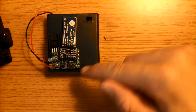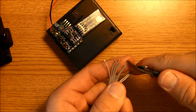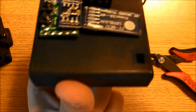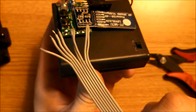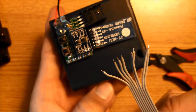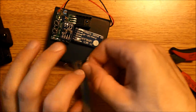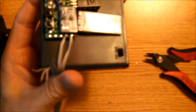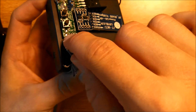Now we're going to solder our wire to this whole assembly. Trim the wires a bit. The two wires you twisted together should be connected to the GND and VCC — they were twisted together to allow the cable to carry a little more power to the matrix drivers and the control board. Connect these four remaining wires to the SW, RX, TX, and reset pads.